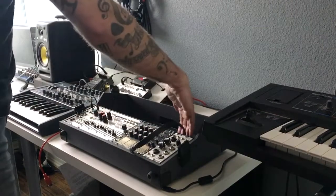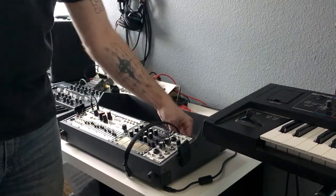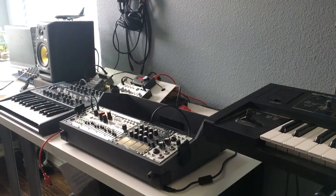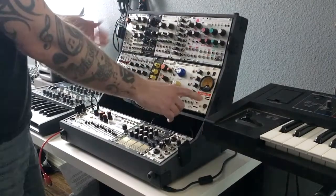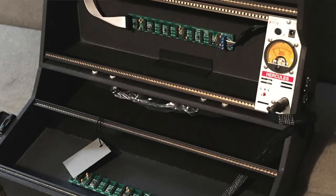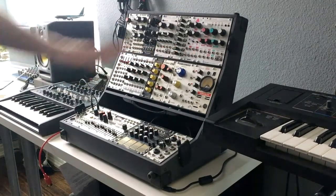This particular wire goes under here and just splits. It's a standard four-conductor wire and it goes to the standard four-screw terminal on the bus board. The same thing with the top section coming off the back of the power supply — there is a four-screw terminal there, and a four-screw terminal on the bottom bus board with a similar wire running between them. Then from the bottom board to the top board, there is simply a Eurorack ribbon cable that connects those together to move power between the two boards.